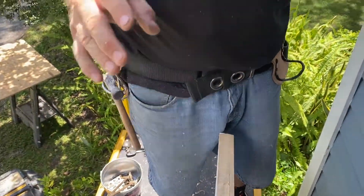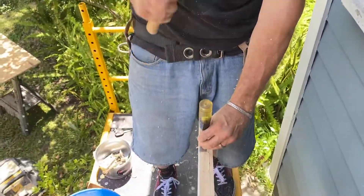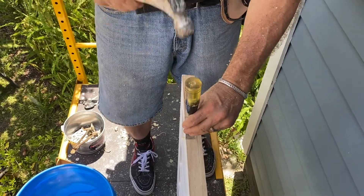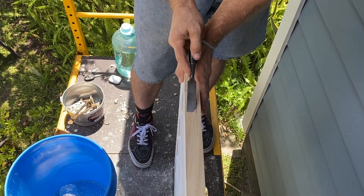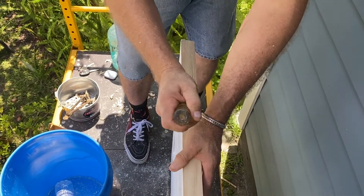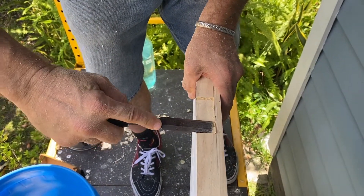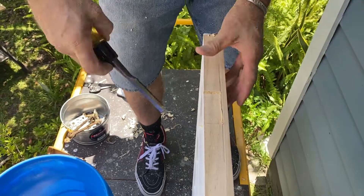What the router really does — the value of the router in this case — isn't for exact precision against the edge lines; it's for that nice consistent depth. Now that I've got my depth, I can take my chisel and hit these lines. I've already got a spot for my chisel — boom. My depth is already right, I've already got a cut here, so I can be gentle and take that out. See how fast that was? Didn't take long at all.